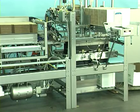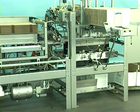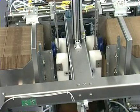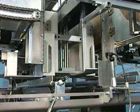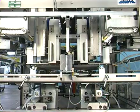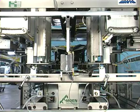Pusher plates engaged into a roller chain positively index the end panels into the pick position. End panels are picked by vacuum cups and dropped into the pre-positioning channel. Five-inch diameter convoluted cups are used whenever possible. Powered end panel folders wrap the end panels around the forming mandrel into a U-shape.